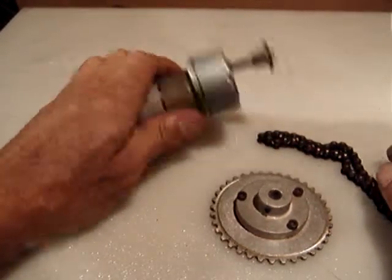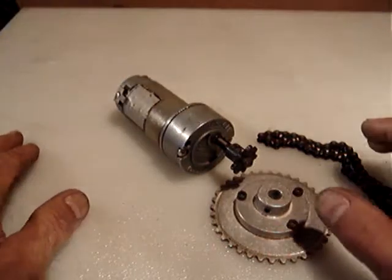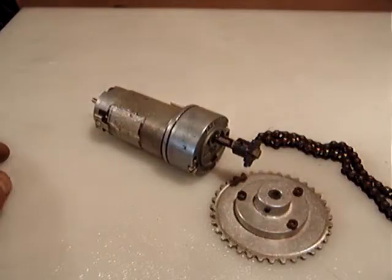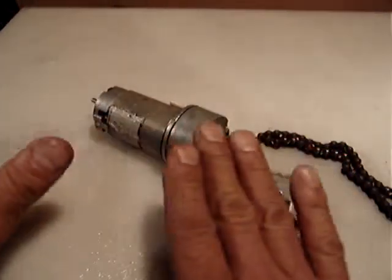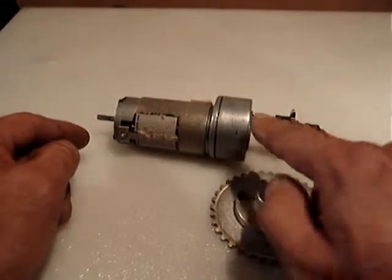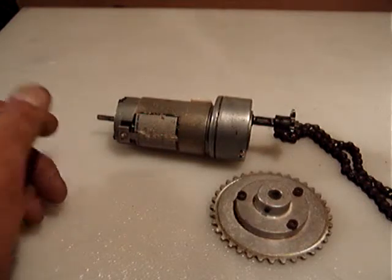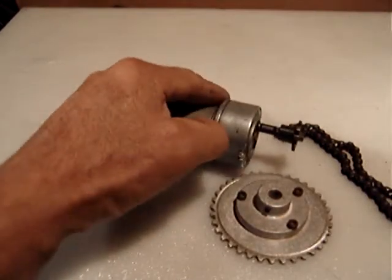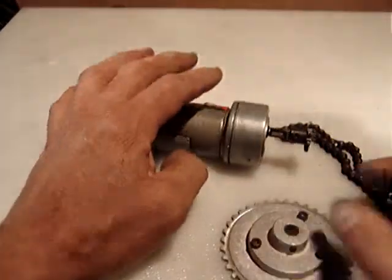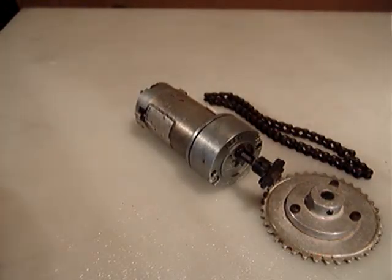I tested the motor for a little bit at 24 volts and it's okay. If you notice it's getting warmer, you can drop to 12 volts — of course everything's gonna drop: the RPM could be around 3,000 and the gear head may turn about 45 RPM. So it all depends. You know this type of motor — you have to play with it in order to get the motor advantage and secure working.